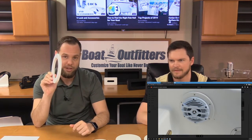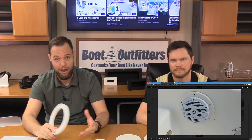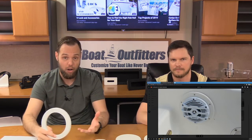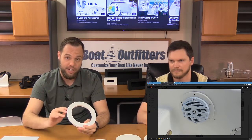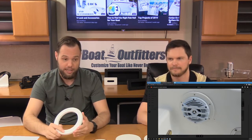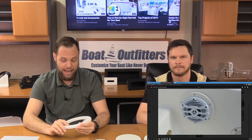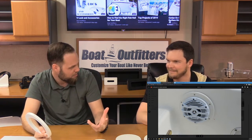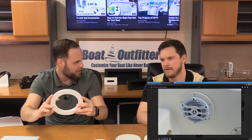This edge, which you can't see very well because it's a little bit hot, looks really nice. It's really clean right off our CNC router, whereas acrylic is more expensive and has to be hand polished to get that high gloss finish on the edge. So acrylic is more expensive and, in this context, I wouldn't say it's as easy to work with, because you're not machining it. We're sending you a finished part that you're gluing in place.